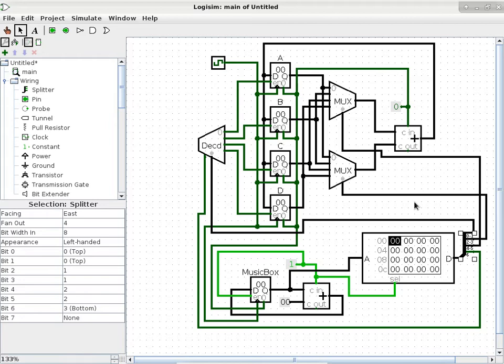So we're building the design one step at a time by introducing, okay, here are the registers. The register bank is this stuff here, and then we have the quote-unquote ALU. Even though in this case it can only do addition, what we talked about today is that we can add additional things that can do calculations, and have a mux to specify which one becomes the output. Then we have an ALU that is capable of addition, subtraction, whatever you want to specify, right? So I want to introduce those concepts one by one to make the design closer and closer to an actual processor.